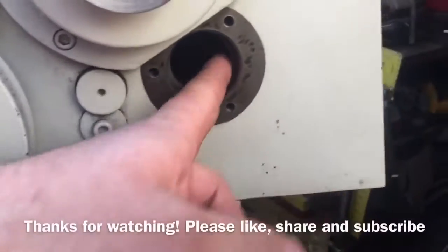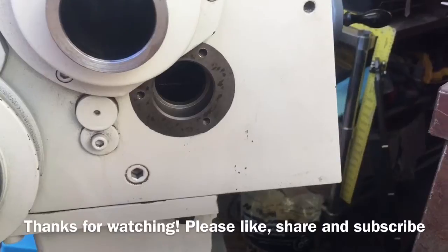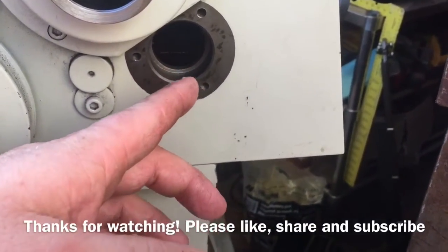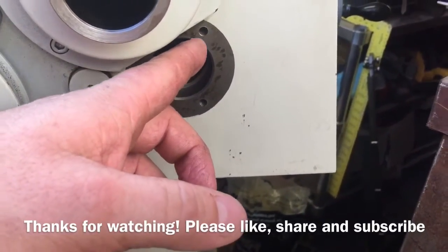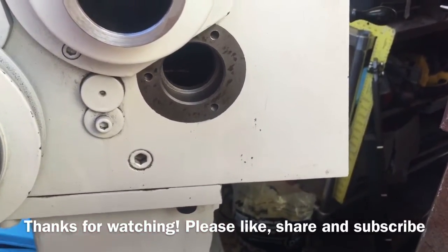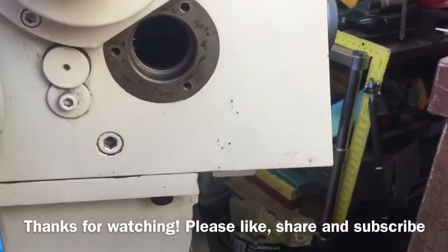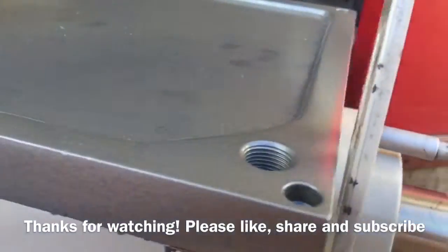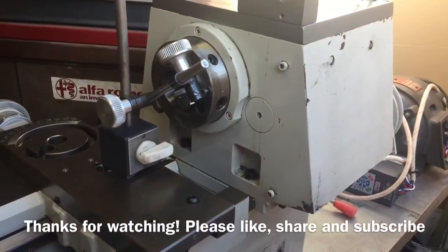The next item is on this end of the headstock — it's the drive for the gearbox for the feed and also the thread cutting. I believe this lathe was dropped and I believe this shaft had been taken out, possibly to get a gear out of it or possibly because the shaft was bent. So one of the things I need to check is whether there's any bend on that shaft — if there is I'll need to straighten it, and if there isn't I'll just need to put it back together again. But that is happy days — very happy days.